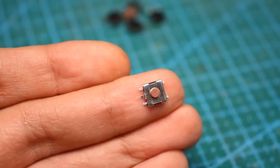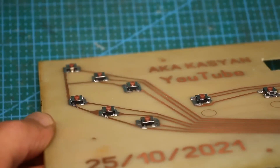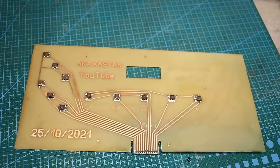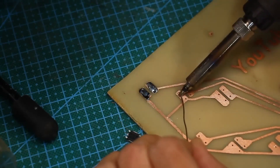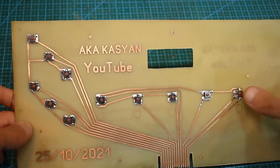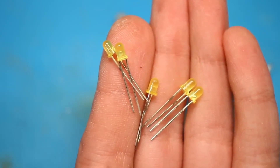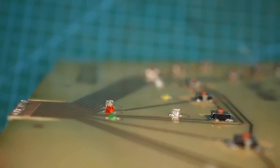I will install regular low-profile buttons — by the way, they are more reliable. A big problem arose with the LEDs. Ideally, I should have used SMD, but I needed to deliver this board as quickly as possible and we don't have any electronics stores here. It's almost impossible to find SMD LEDs of the required size from local vendors. And I soldered all of this at night because it needed to be delivered urgently that same night. Some might think I'm just making excuses for the tech perversion that will follow, but in reality everything was exactly as I said. The tech perversion lies in the fact that I ended up sticking 3 millimeter LEDs here, but with the top cut off. They're under a polyethylene panel, so this ugliness won't be visible to the human eye.